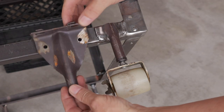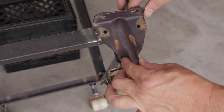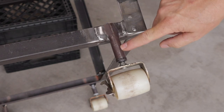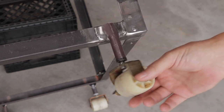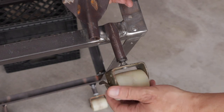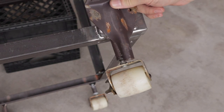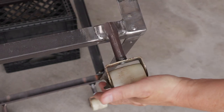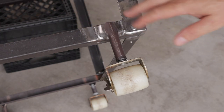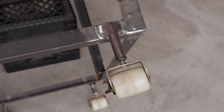Basically, I just took one of the stock caster mounts that came off the recycled bed frames and cut it down so it's not so far away from the corner. Then I just welded it to the frame, stuck my caster wheels in there. These have a little plastic insert — this one's missing the plastic insert that the caster wheel pops into. I just took a pair of pliers and pulled that out to weld it up so I didn't melt it, then stuck it back in, popped the wheel in, and did that on all four corners. It came out really good. These wheels are kind of old and crummy, but they're going to be fine for this little cart.